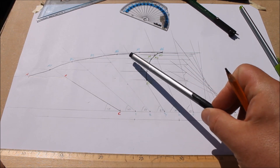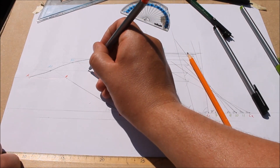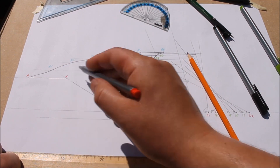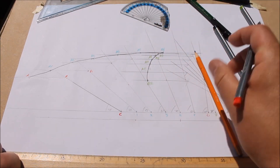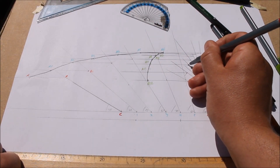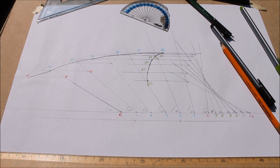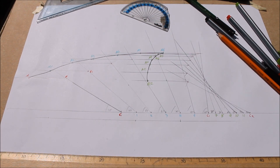Each one of those marks represents the position of B as it rotates. We knew the angle, we knew the distance from C to B, and A is always horizontal from B at the same distance of 60mm — you just keep applying the same constraints over and over. That's a nice linkage question, and that is the 2017 C4 question finished. I hope these tutorials help. If they do, please like the video — it gives me feedback. Subscribe so you know when I upload. Good luck in your exams and we'll see you in the next one.